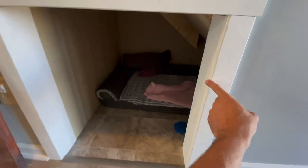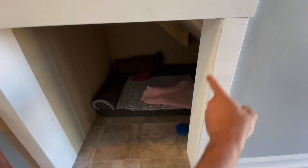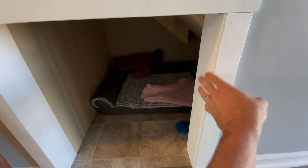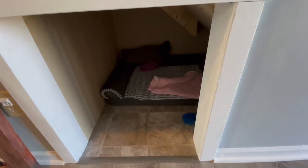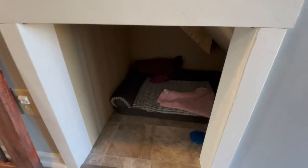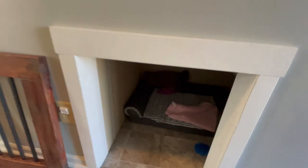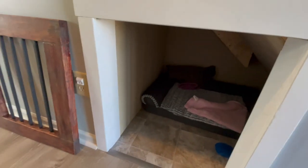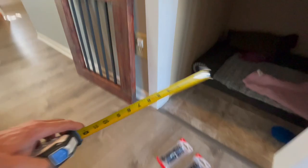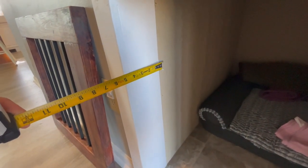I thought it might make it a little bit more rustic, but I end up painting it anyways. But I took a masonry grinding blade on my grinder and I just smoothed these edges and then I sanded them. I kind of rounded them off. You could router them, something like that, but this was a quick option and got the job done and I got the results I wanted. So went ahead with that, and this trim in here is actually another form of door casing. It fit perfect for the 2x4.